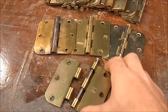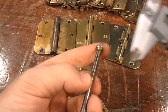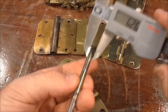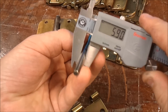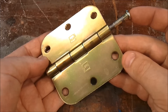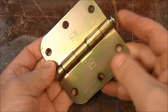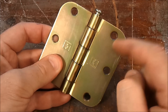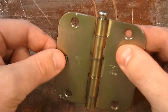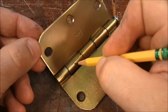I've looked at four different brands of hinge by now, and they all seem to share this one thing in common. You can see the pin that the hinge rotates on is fatter near the top. This is the case for all four of the brands that I looked at. The pin being thicker at the top causes a friction fit at the top of the hinge. What this means is that relative to this half of the hinge, the pin doesn't move — but this half of the hinge is free to move. So I want to cause there to be friction on this part of the hinge as well.